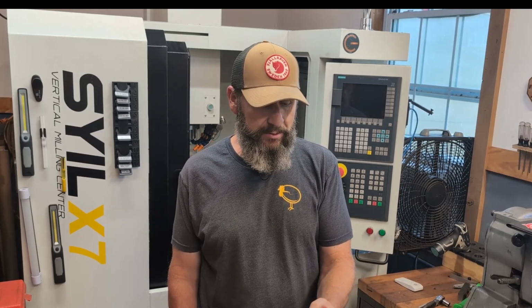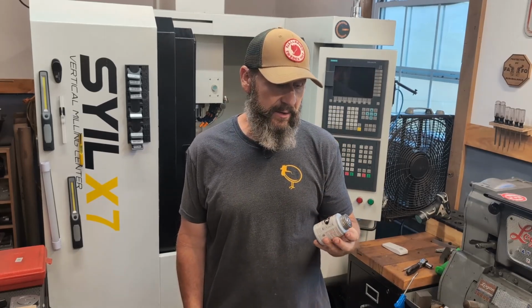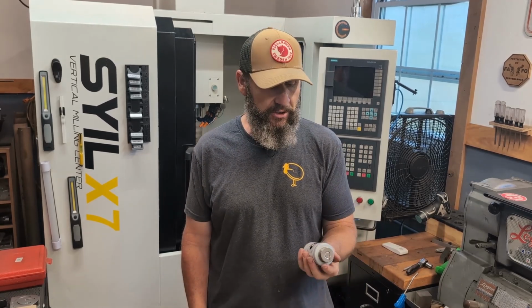The pipe sealant I just got at the local tractor store, T+2 pipe thread sealant. So I went ahead and applied this to the inside of the threads and the male threads, the female and the male, and then put my new drain plug in, and it didn't leak from the start. So for me, this was a game changer.